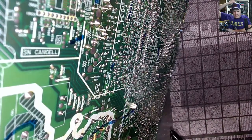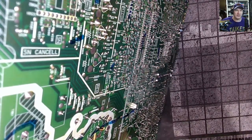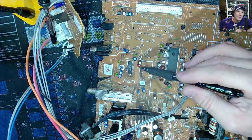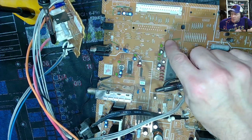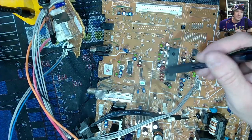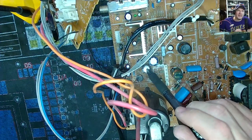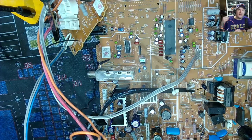No, Ash, I don't agree with that either, because it's really a waste on some of these things to replace every capacitor on some items. Like, this television does not need to have all the capacitors replaced in this area. First off, they're not high capacitance. They're not going to get high heat, so they could literally last 20 times longer at the temperatures they're sitting at than the ones over here. So theoretically, you could say that these may need to be replaced 3 times before you'd ever have to worry about replacing these. And those caps could last 50 years.